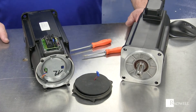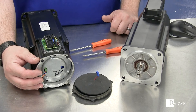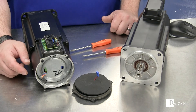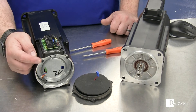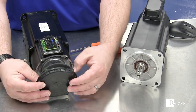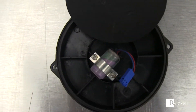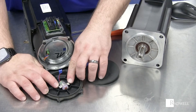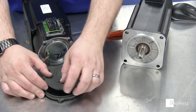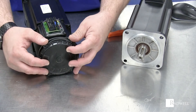In order to replace the battery in the field, it's a really simple operation. On the small motors, MKD 025 through 041, you're going to have a T10 Torx here — there's going to be four of them. On the larger motors, the 071 through the 112s, it's going to be a T20. Remove these four screws. The battery is going to be connected with this connector right here — go ahead and pull it off. Pull the gasket through and you're going to have two T10 Torx holding the battery clip in. Just pull these two out, put your new battery in, replace your gasket, put it back on, make sure you plug in your connector and put it back in. It's a very simple operation. This should be done every couple of years.